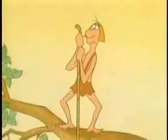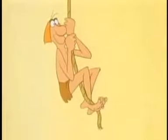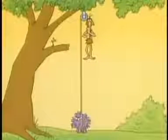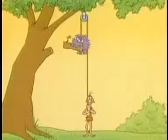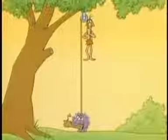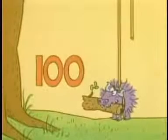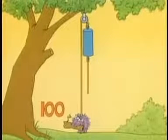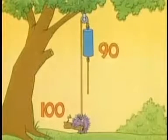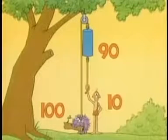If you lift something by pulling it up, only your muscles do the work. But when you pull down, your own weight can help you. Using your own weight as a force, you can raise something that weighs less than you do, but not something that weighs more. But with a pulley, you don't have to use only your own weight. Suppose you want to lift something that weighs 100 pounds. You could hang a counterweight on your end of the rope. If the counterweight weighs 90 pounds, that wouldn't lift the load — but all you'd have to supply is the difference: 10 pounds of force, and you could lift it.